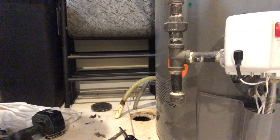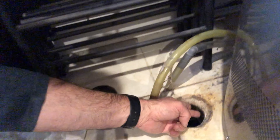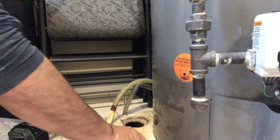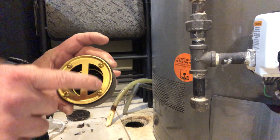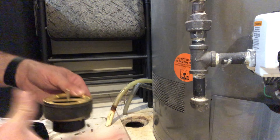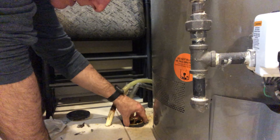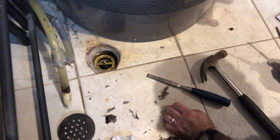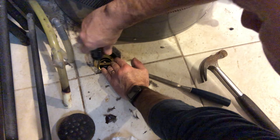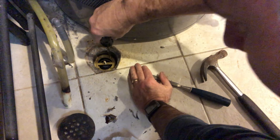Here's the drain — you'll have some hoses here, take it out. Clean this up because the cement overlaps, so you've got to make sure that it fits properly. You're going to put this in, then with your regular screwdriver, you're going to tighten these ones up. What happens is it pinches and then this rubber expands out, so it's really tight in there. Once you've cleaned this out, hopefully we're going to be able to slide this in here. Then you're just going to go around and make sure it's flush. We're going to tighten it around.